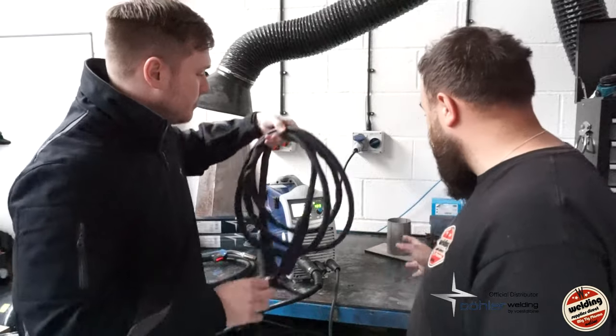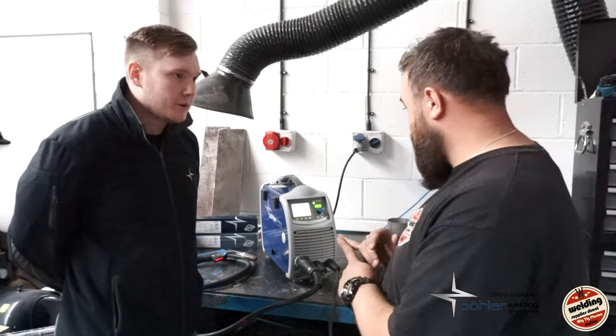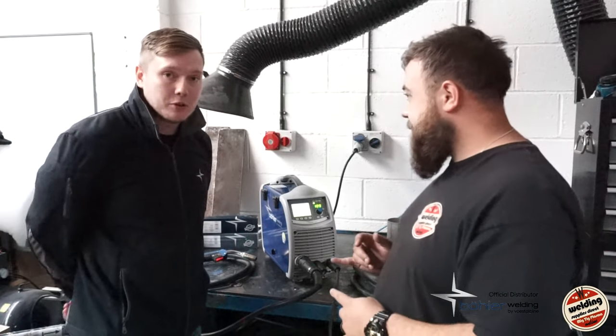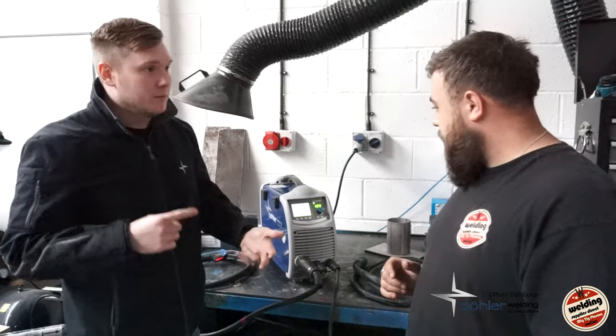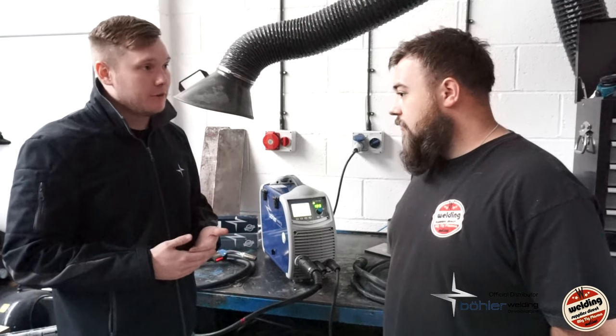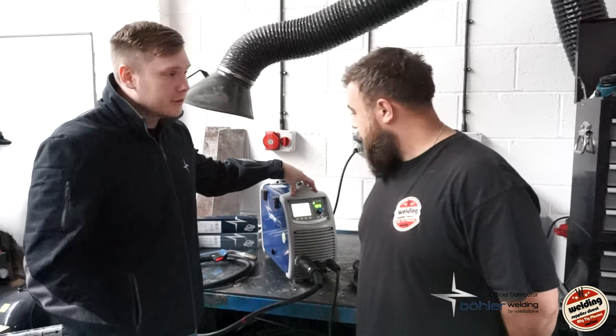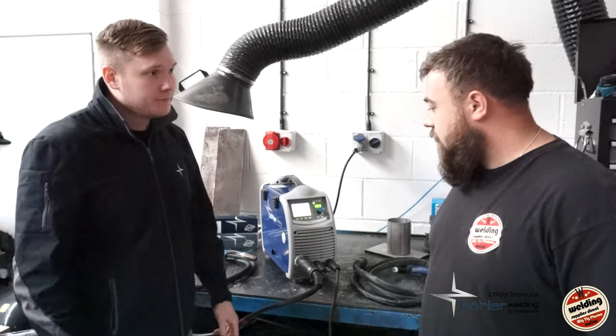As features go I'm pretty impressed — I like the bits that come with the machine and the build quality. And these are only 240 volt at the moment — correct? If people need more than 200 amps, or are running one mil or 1.2mm wire daily and consistently, we do offer a 270 amp version from a three-phase supply. But this is a 240 volt, 200 amp machine capable of running 0.6, 0.8, or 1.0mm wire. We're going to show you some welds — first the one mil spray, then dip transfer on the thicker wire to see how stable it is, and then TIG and stick as well.